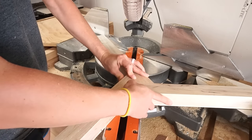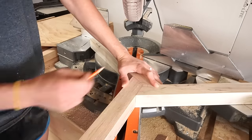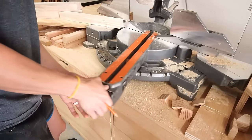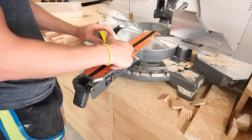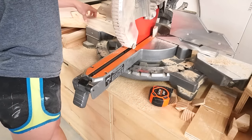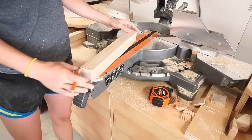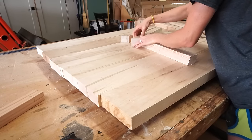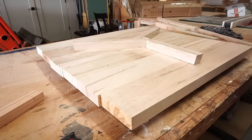I brought these pieces over to the miter saw and cut one end of each piece with a 30-degree miter — these ends will fit together in the center. To make sure I cut everything in the right direction, I fit these pieces together, marked the top, then marked the other ends with a line showing how to miter those. These ends need to be mitered so that the bottom is longer than the top so that the legs will slant in from the bottom to the top. I adjusted the miter angle to 10 degrees for this, measured these to about 15 inches long, and cut. I repeated for all three pieces, then double-checked the angles were right and the pieces fit.